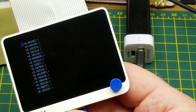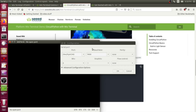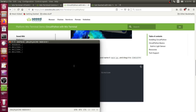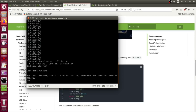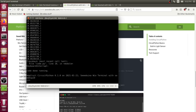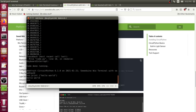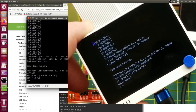Conveniently it's showing it on the little handheld screen here. This is fairly standard stuff a tinkerer might want to do. In CircuitPython, like any other Python implementation for microcontrollers, you can connect to it with REPL — basically a serial connection. It's echoing what's on the screen of the thing right now. I hit Ctrl+C to break out of that, which takes me to the command line.